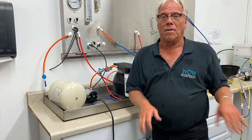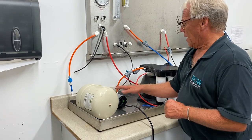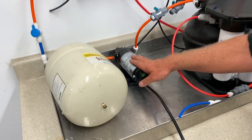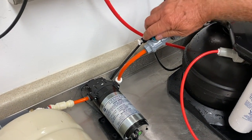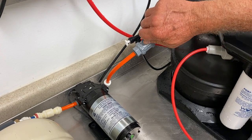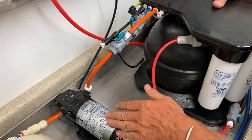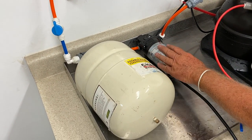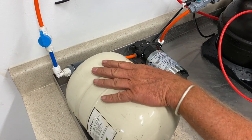Right now I have set up a smaller captive air tank, the DDP-5800, and it's running right now only because I have not turned the system on. Here's my isolation valve — there was enough water in the system here to populate this tank. Now the pump has quieted down; it's drawing water and pushing water into the tank.